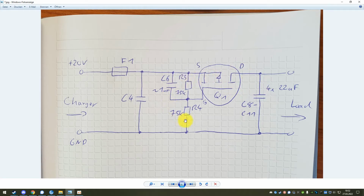And this circuit is not designed to operate continuously. It's designed to be operated once when you plug the charger in, and then be basically a closed switch for the rest of the time. So this circuit is not designed to handle a continuous amount of power put into it. But this is exactly what happens when there's a short circuit.